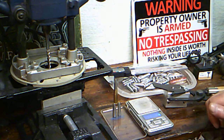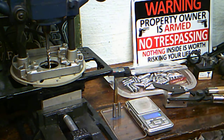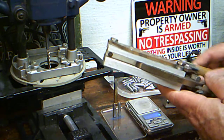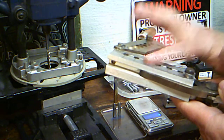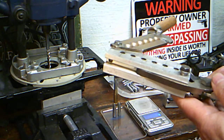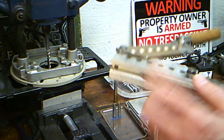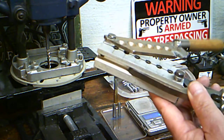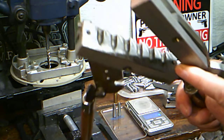On one of my other videos, I machined off the gas check on a 312-155 grain Lee mold and came out with a 137 grain flat base bullet, and it shoots awesome — it's pretty much my go-to supersonic bullet for the 300 Blackout.